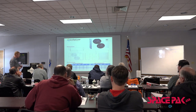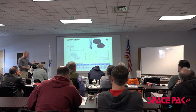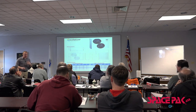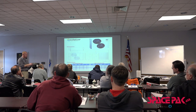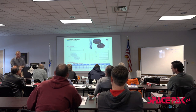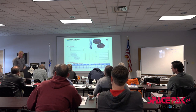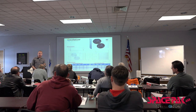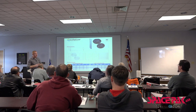What will this unit do? This is a funny slide because it's nice and small, right? But we've got this unit rated down to -5 outside ambient. So at -5 outside ambient, it will deliver 40,000 BTUs of 130-degree water. Okay? 40,000 BTUs of 130-degree water. So it's going to make that buffer tank inside 125 degrees, because generally if we're making 130, we won't try to make 130 inside. We'll have a couple of degrees differential, right? So we're able to overshoot it a little bit.